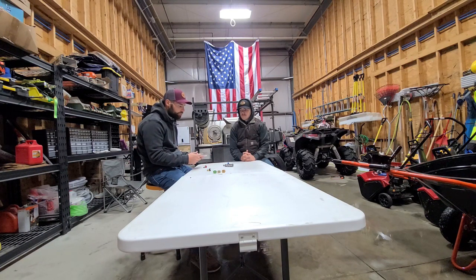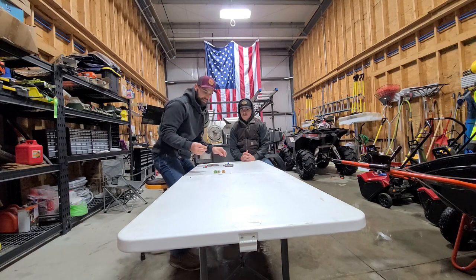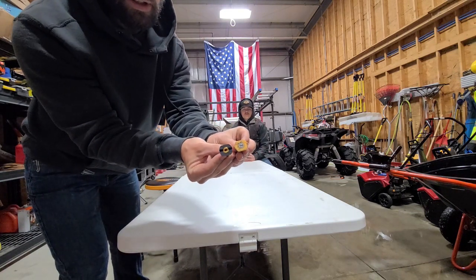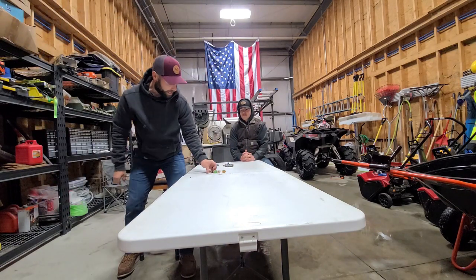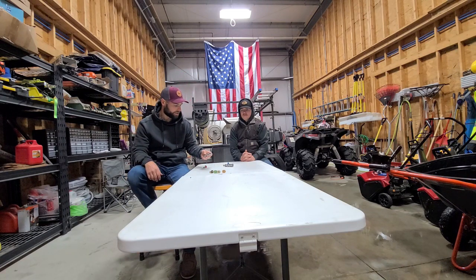If you are using too much pressure, if you're using one of the higher pressure nozzles here, you won't be able to draw soap. If you need to use a lower pressure, which I don't know if you can see it or not, I can try to get up to the camera a little bit. The difference between the size of the orifice of these two. So this is your soap one. It's much larger, so the pressure is going to be a lot lower. So that's how we actually are able to control the pressure that we use on a home, is basically with the different size of the tips that we use.